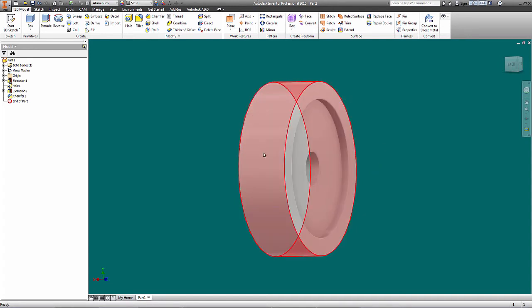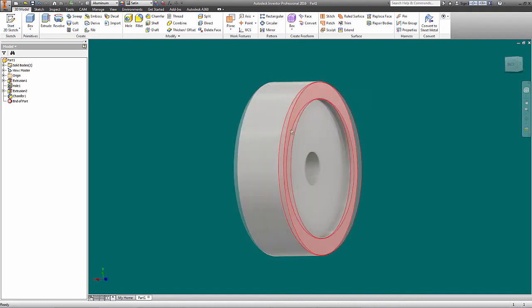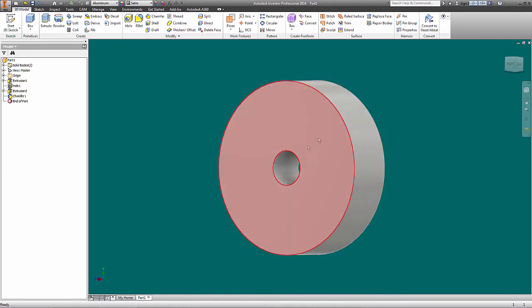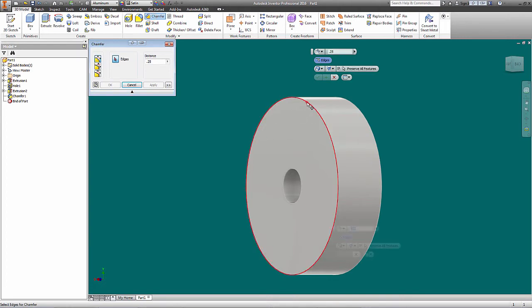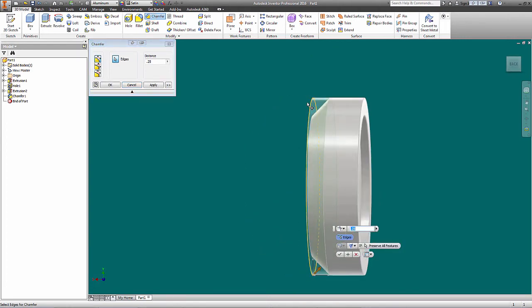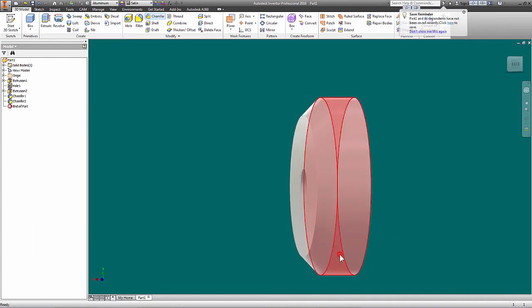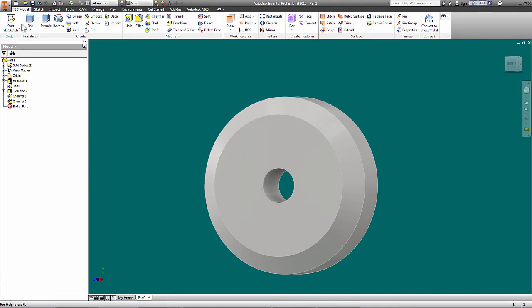Now I need a way to grab the shaft with a wrench or something so I'm not working the gear train on the machine. I could throw a couple of radial holes in here and stick a peg in there, but I always have the collet wrench right there at the lathe — so why not make this to fit a collet wrench? Why do something simple when you have the means to make it hideously complicated? Let's throw a chamfer on that edge — a quarter-inch chamfer. Groovy.